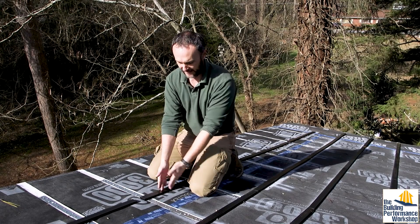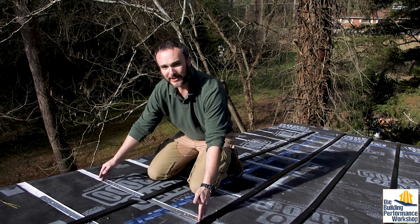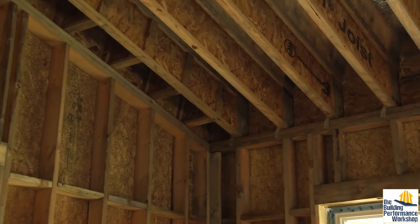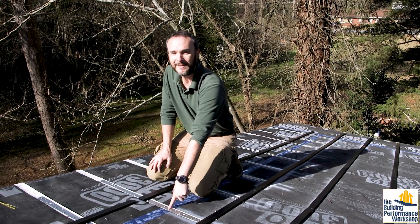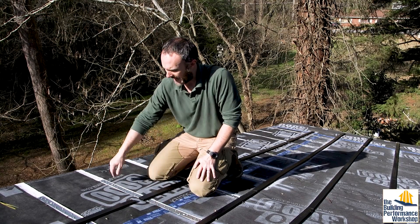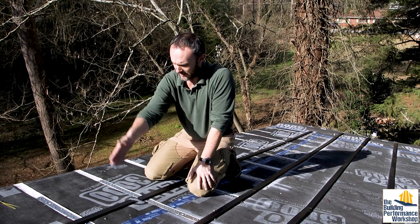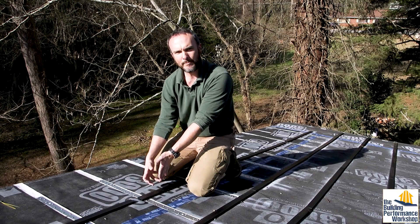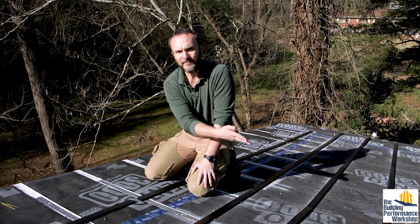Now I'm straddling the edge of the house. The enclosure is this way and the eave we added in one of the last videos is here. The structural engineer specs these 30-inch straps, and on these gable ends — a rake wall — we have straps echoing the blocking we put in, basically switching the orientation of the roof rafters on the inside. I didn't take the backing off this tape because it's not important for the tape to stick to the strap since I'm nailing the crap out of it — every nail hole filled with 10d nails. The strip needs to go over a structural member, so I've got it over the edge of the house which has a ledger on the outside and a rim board on the inside. The lattice will run perpendicular to this.